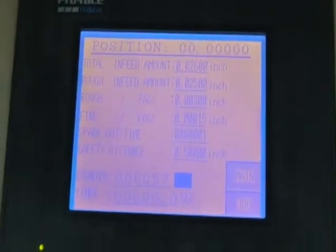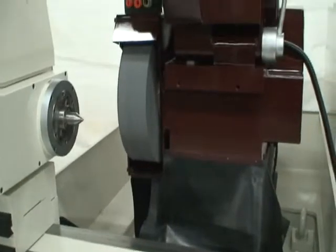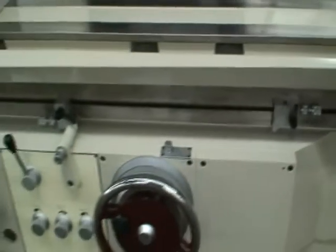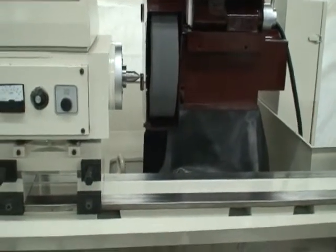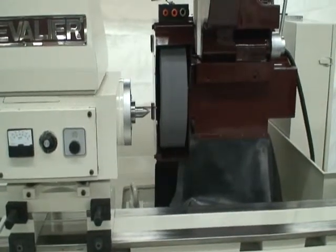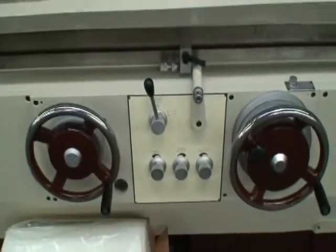It's equipped with a touch screen operators control panel, very easy to use. The basic cycles of the machine are reciprocating grinding with an automatic infeed, plunge feed grinding, and internal grinding. The machine cycle in a reciprocating grinding mode pick feeds or infeeds automatically to a certain point, reaches the point, will spark out, and then return and stop the machine in position, ready for the next part.